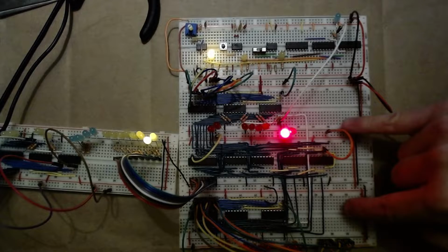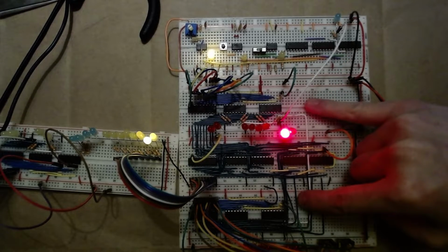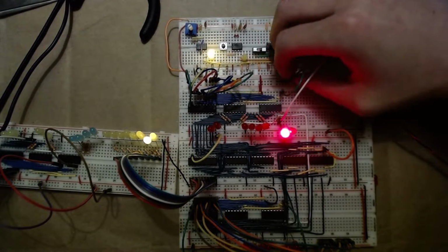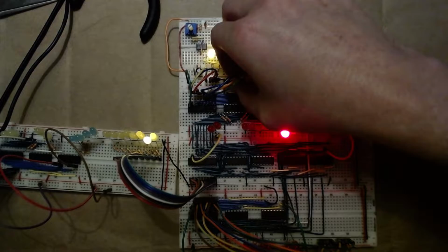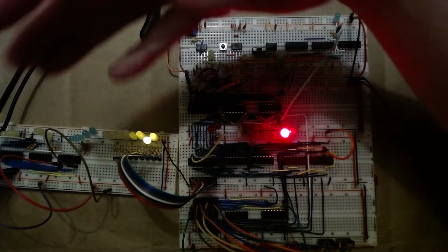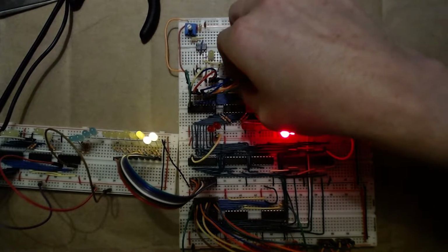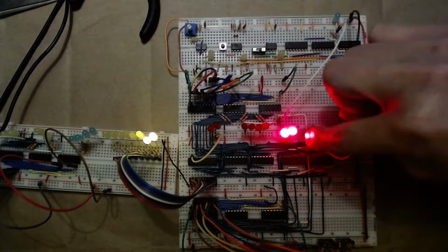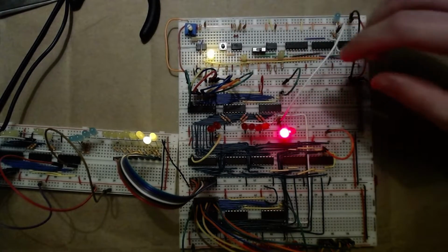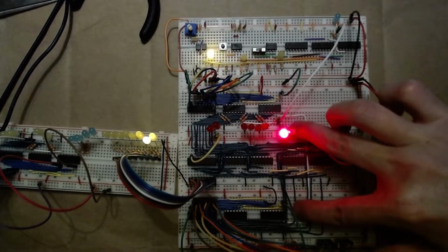What I did this time is first I made these two what's called registers. So I can put data on here and then move data from the bus or the outside of here. I enabled the inputs and then I could turn it on. And then I could turn off, I'm just going to turn off this LED, just this one, by pulsing it. Right? So that's what these two things can do, this top and bottom module.